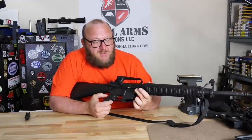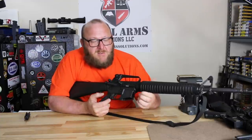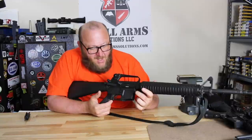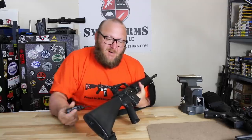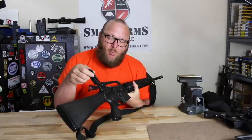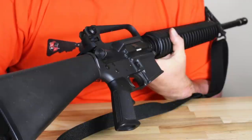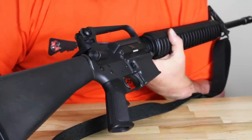Another change: at the time this rifle was put out, it came with a standard front pivot pin but had a screw and collet on the left-hand side. I didn't like that, so I took this to a machinist in Hemlock, New York, who drilled the pilot hole so I could have the standard captive front pivot pin. I also added a forward assist — an early flat-style forward assist from early M16A1s. When the A2 came out, they had trouble fitting it because it was oversized; Colt had to machine off the flat so it would function. It was replaced by the smaller forward assist that became universal early in the M16A2's production. I added it because the rifle I had back in 1990–91 had this type of forward assist.